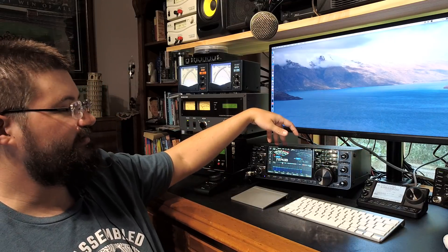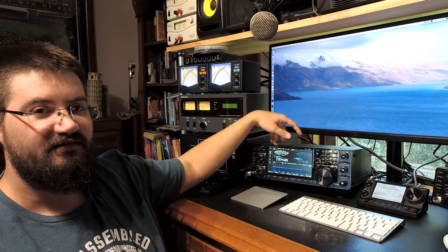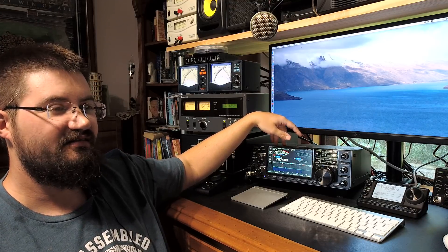If you're serious about your audio quality, get yourself a boom mic — it doesn't have to be an expensive one. Almost any cheap mic will do a great job with the built-in EQ. These radios sound absolutely terrific, with great highs and lows. You can do a great job even with a $20 condenser on a boom mic. I recommend dynamic over condensers — Bob Heil will tell you a lot about that. Condensers pick up everything in the room, but they still can sound quite nice.